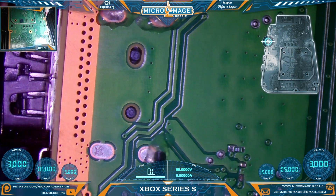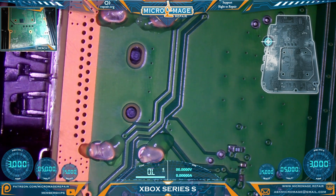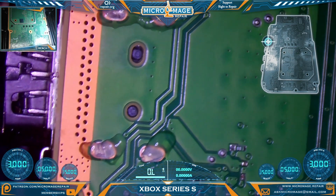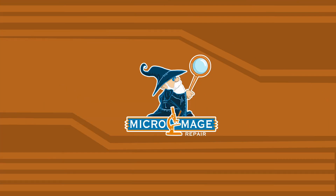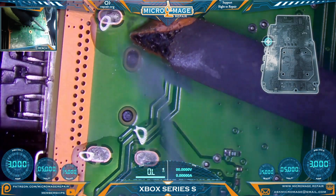We'll apply some flux — that will also clean a bit. Flux is a cleaning detergent. Now we're just waiting for the flux to liquefy; once it does, we'll know our board is warm enough to begin the removal procedure. Our flux is liquefied and we're going to begin by applying some low melt to our anchors.